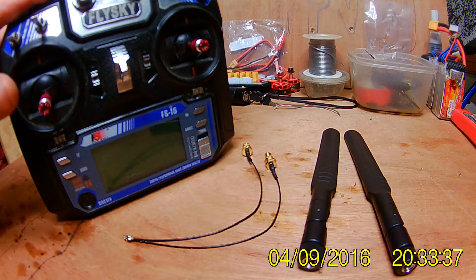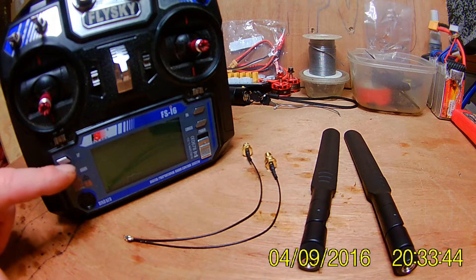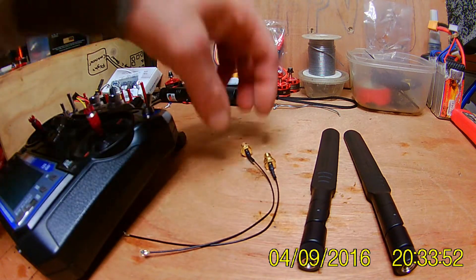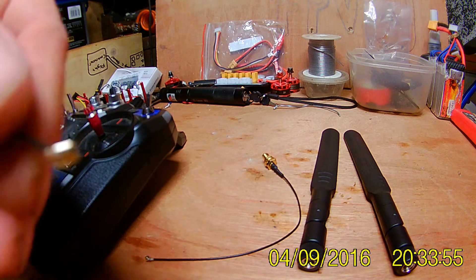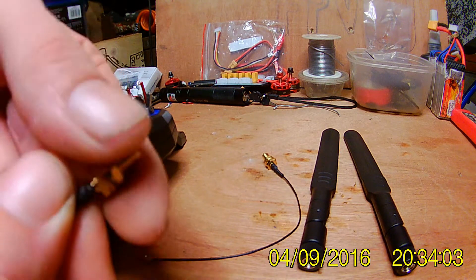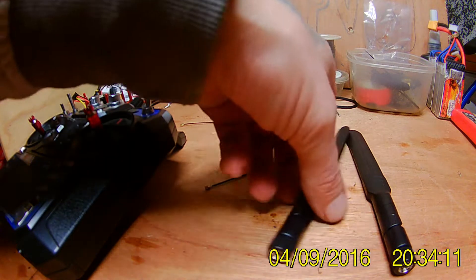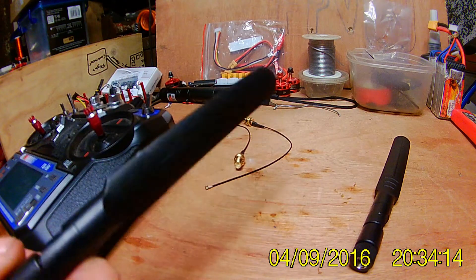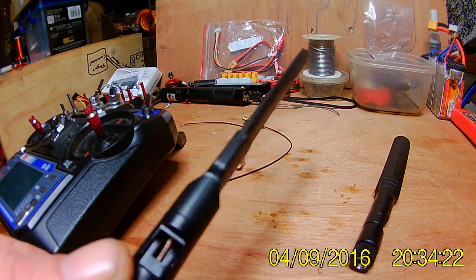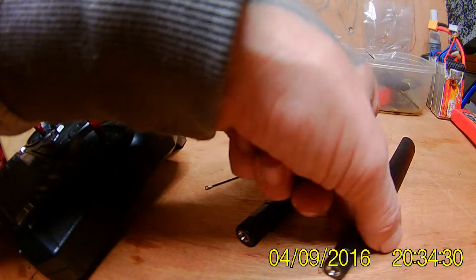What we are going to do is upgrade the antennas in the FS-I6 transmitter, so we are going to have to take it apart. Here are these little connectors — a little push-on clip — and then an SMA bolt attachment. We have two of them, I will put the link in the description. These come as a set, two WiFi antennas, 2.4GHz, and I am sure they were 10dBi but I will let you know. You can change to different ones; I have got these two which I am going to run most of the time.